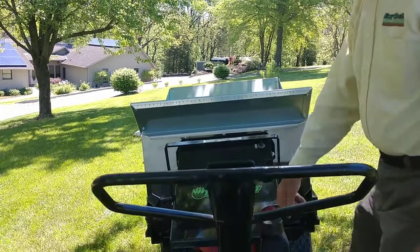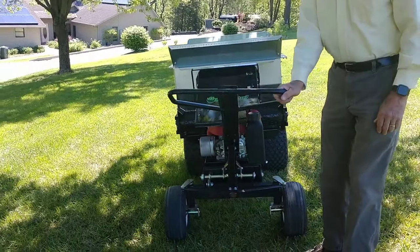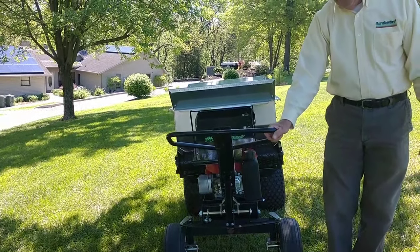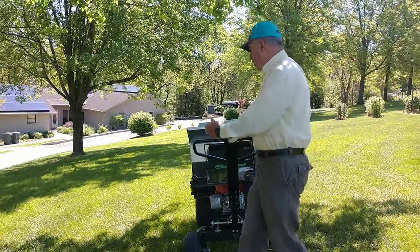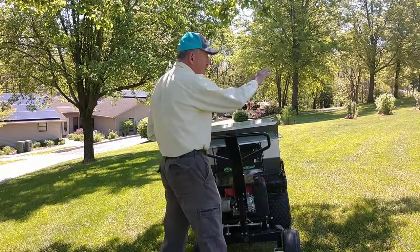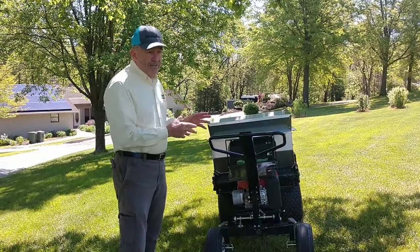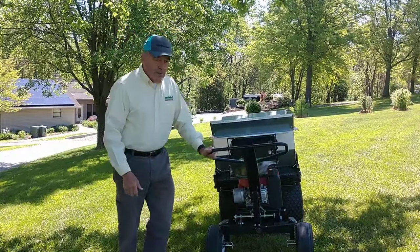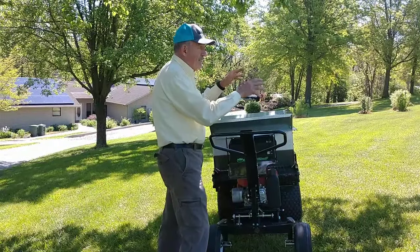This is the handle that runs the machine. When you press down on the handle it goes forward and you're walking alongside this machine — not in front of it. If you want to go backwards, generally people grab it and pull up on it to steer it back into a tight spot, then spread away. Because it's clutched in reverse, it does not spread in reverse — it only spreads going forward. Reverse stops the spreading so you don't double spread, and it gets you back into tight spots.